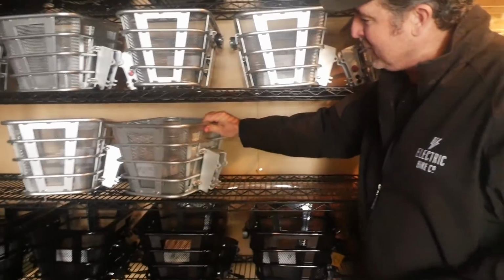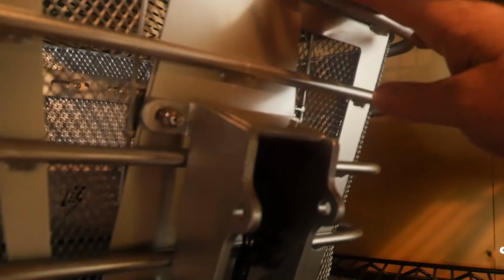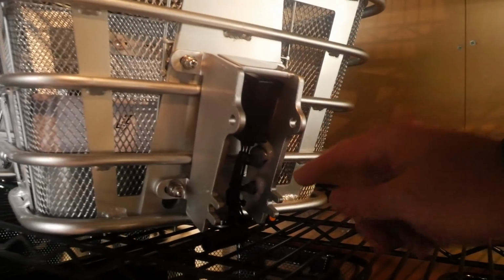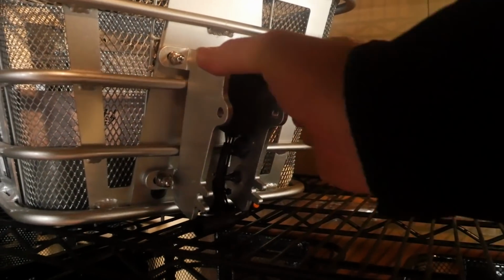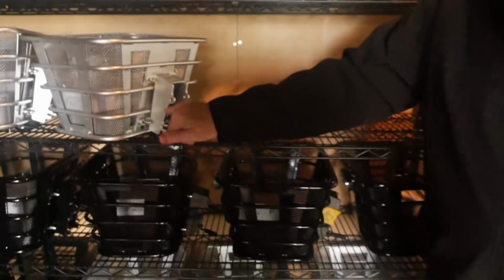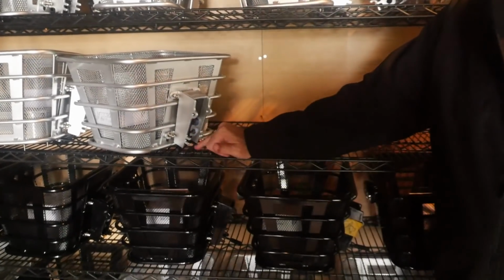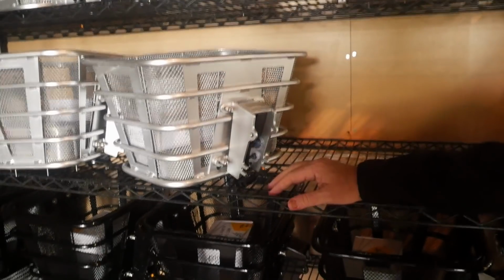It's obviously through our design, as you can see. People say, "Where's your alarm?" Well, now you know because you've taken the time to go see our factory. We stick the alarm on this particular one inside the bracket of the basket, which is a nice sturdy bracket. Then we have our charging port and an on and off switch tucked in here, and this gets attached to the bike. So it hides all the wiring. Now for service, there's 4 plugs, 1, 2, 3, 4, and these plugs can unplug. They could just get unplugged and sent back to us, and we can service this entire battery pack.